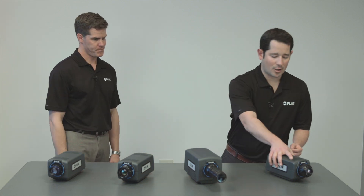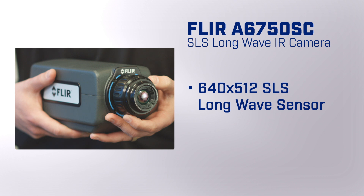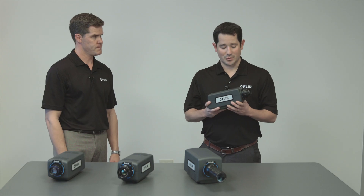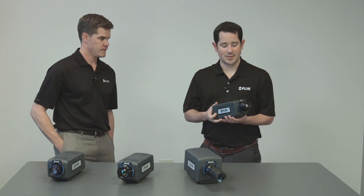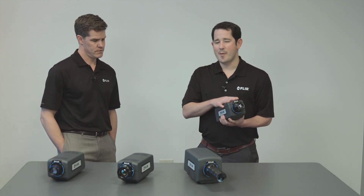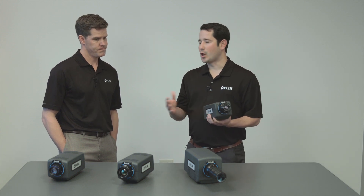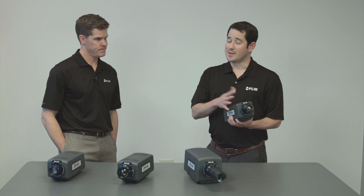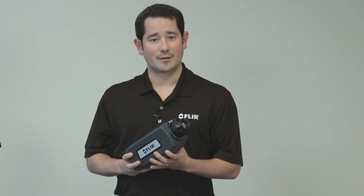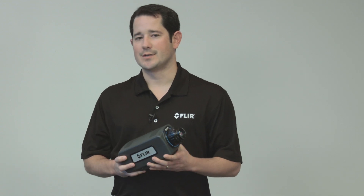Let's start by talking about the long-wave SLS camera. This is a 640x512 SLS long-wave sensor that goes all the way out past 9.5 micrometers. If you remember the legacy QWIP detectors, they had great quantum efficiency but pretty long integration times. The MCT cameras still prevalent around the world had really not that great uniformity but fairly short integration times.